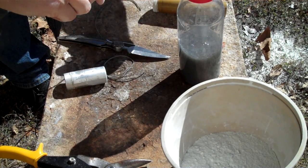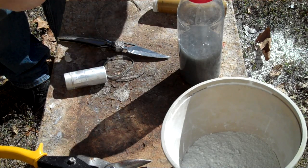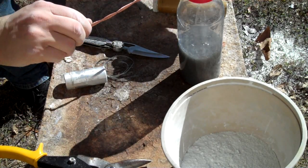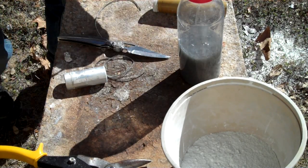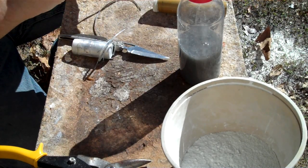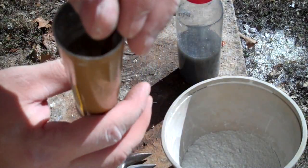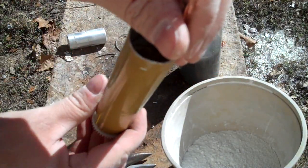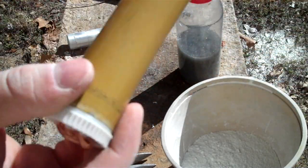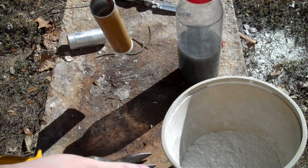The important thing is to get the wire straight because you don't want it touching the inside walls. Get it straight by twisting and pulling on the wire. Now I've got this wire in here. You want to secure it because you're going to pull on it to keep it straight while you're pouring the cement.